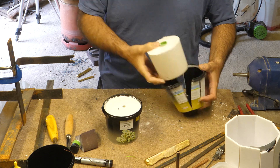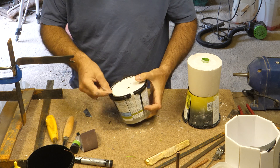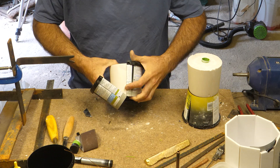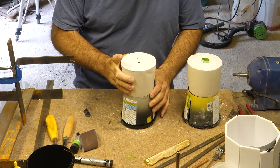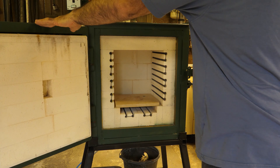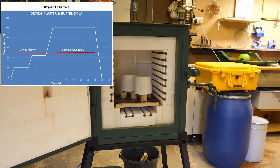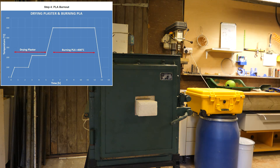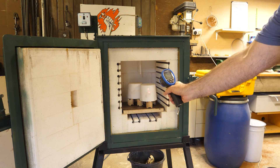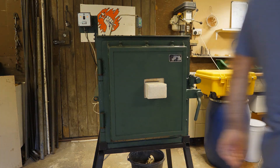I remove the molds from the plastic tubs. This is the hollow one with the core. And I put them in the kiln to start the burn out process. Now, as usual, I've never done this before, so I'm sort of making it up as I go. But I did find this super chart online — there's a link in the description — so I tried my best to follow it. I get the impression it's good to pour the molten metal into the mold while it's still hot from the kiln. But I'd run out of time for this day, so I switched the kiln off with a view to doing the high temperature part of the PLA burnout the next day.